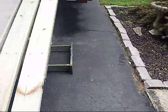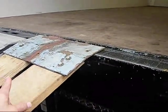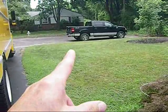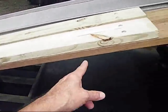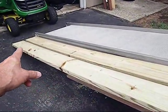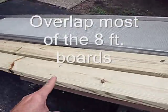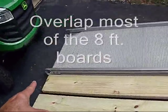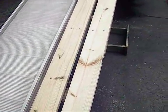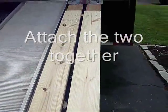So what I did, I took a regular truck ramp kit that you would use to load something on your pickup — two by eights by eight foot long, and I added to it two by eights by twelve foot long, so it would extend all the way to equal the length of the ramp. Doubled it up, as you can see. These are attached to give it more support and stability.